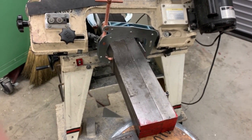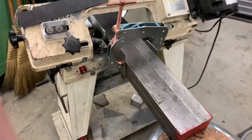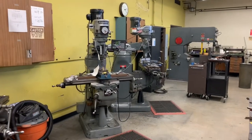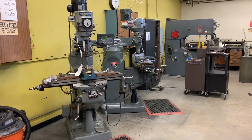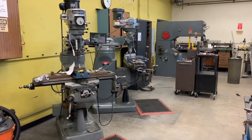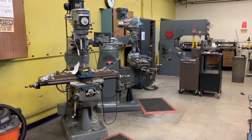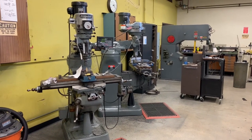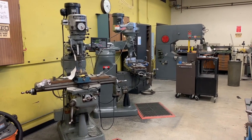It's probably going to take another two hours just to cut the plates, then I'll have to come over to my milling machine and mill the tenons at about a five degree angle so they lock into the quick change die system. After that I'm going to have to go over to the welding shop and weld them together — and that's just for the die plates, not even for the actual dies themselves.